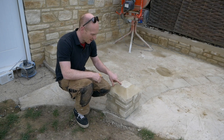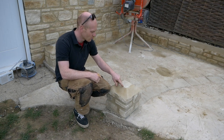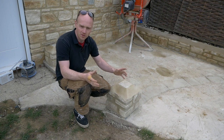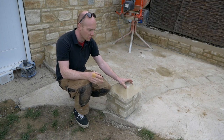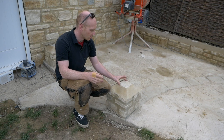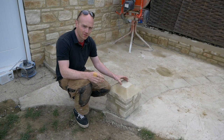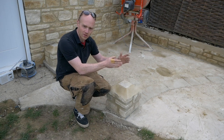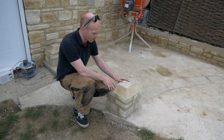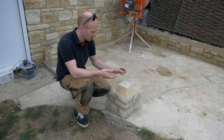Now we're working out how we're best to do this. We're just making this up a little bit as we go, but it made sense to us. Rather than having 150mm square on top, we've shrunk that in by about 5mm on either side, so that the oak overhangs just by a fraction, figuring that the rain would make its way away from it. It wouldn't pool underneath anymore.